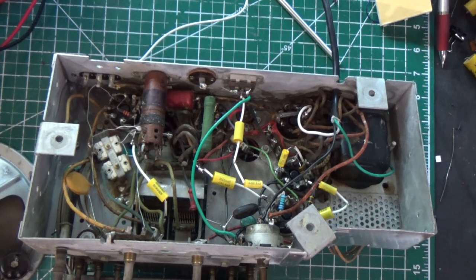When you have a problem — like with our solder bridge and rectifier tube — how do you find it? There are really two methods. One is the shotgun approach, where you just start replacing stuff: test all the resistors, coils, everything out of spec. Sometimes it works, sometimes it doesn't. What we really need is a more controlled method. As you know, there are two sections in a radio: the RF section and the audio section. We want to follow the signal path and only check the necessary parts as we go into each section.